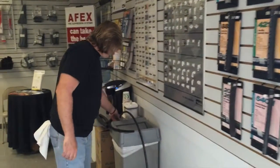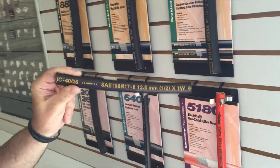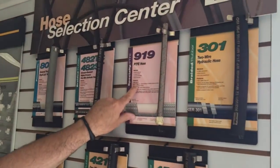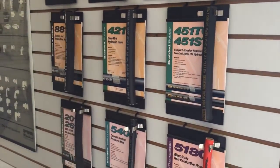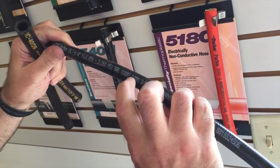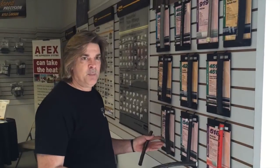That 100R rating is an SAE standard that's pretty much the same across the board no matter what the manufacturer is. It stands for the Society of Automotive Engineers. That 100R rating is noted on the hose whether it be our hose or anybody else's. Basically what that tells you is what the cover type is, how many wire braids are running through it, and typically what the core is — whether it's a rubber core, or like this one which has a Teflon core with a 100R14 rating, this is a 100R17 that is a rubber tube, or it could even be a synthetic core which has a rating of 100R7. That's going to relate to what the hose is made out of and should give you some clue as to what you typically want to run through it.